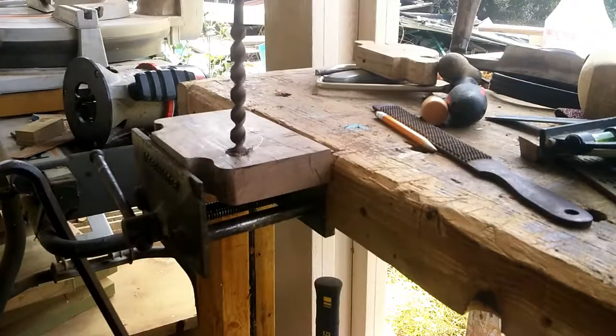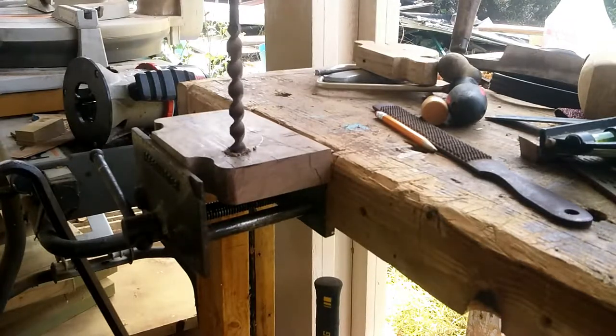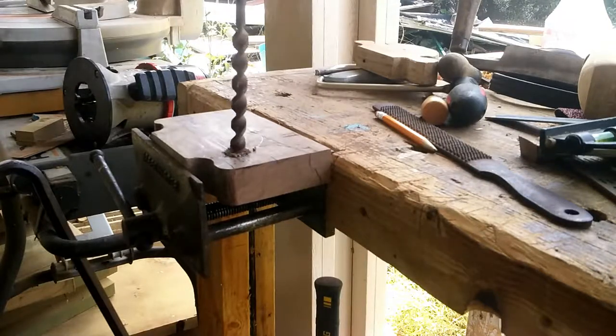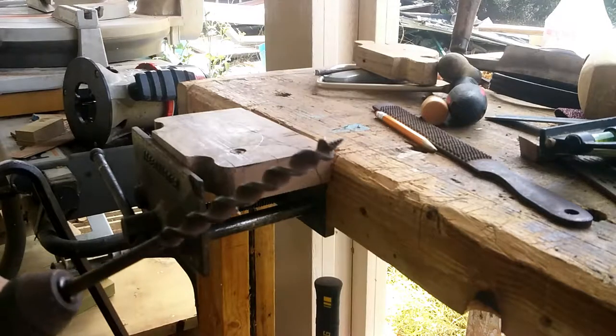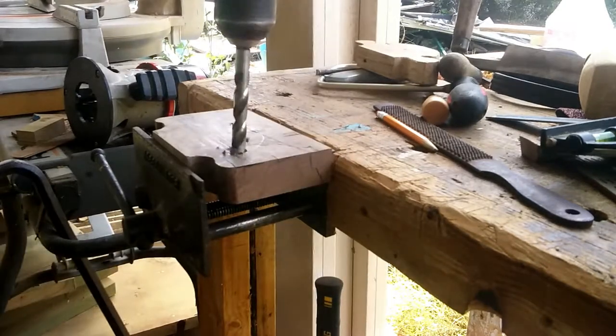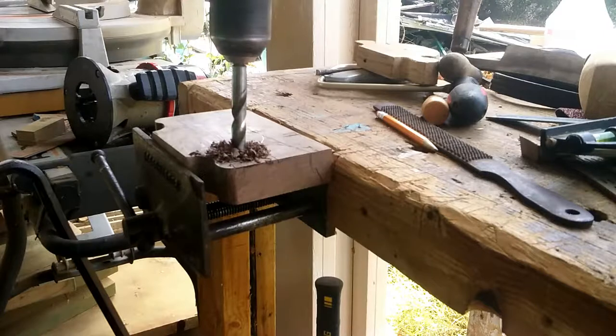On the interior curves, which I had tried with the jigsaw and then with other implements, I decided I was going to auger out the holes, but my auger was dull beyond repair. It's a very old auger — I received it as a sort of an inheritance. So I just used it to mark the holes and then went to my cordless drill and a half-inch bit to drill out the shapes.